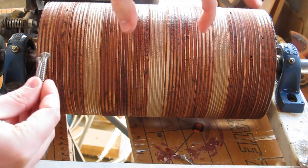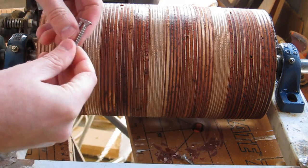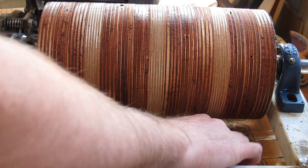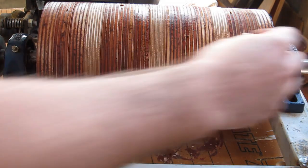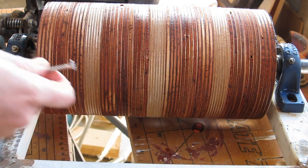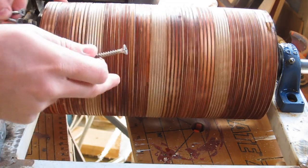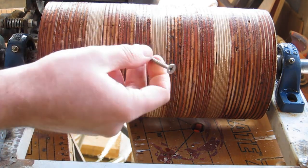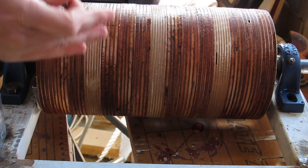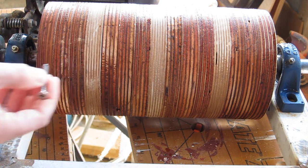Make sure that if an apple's hanging there, stuck in the way, it's not just getting the same bit cut out of it each time a screw goes past, it'll actually get completely machined away. Obviously I can't put them all in one row on such a tight pitch because I'm not drilling holes that close together. So I'm going to put them round in four locations around the diameter and put them 20mm or so apart and then stagger the four rows slightly so that it covers all of the positions.